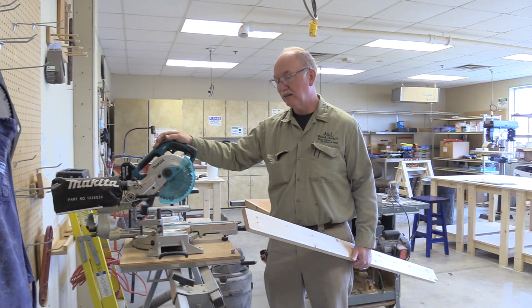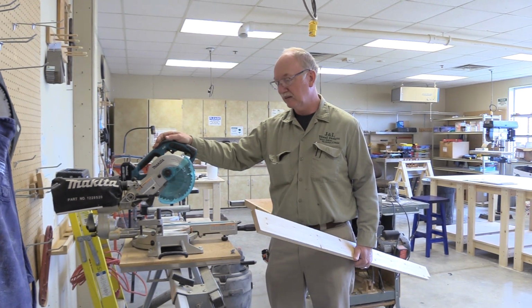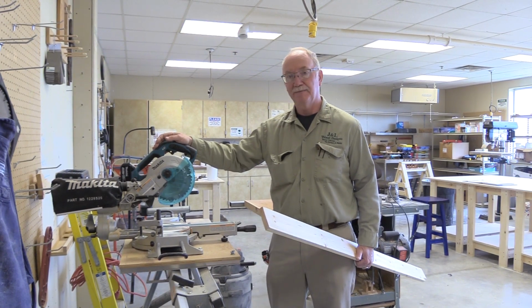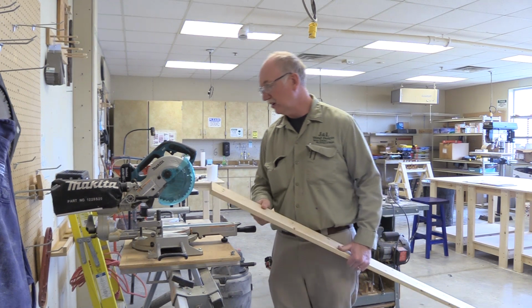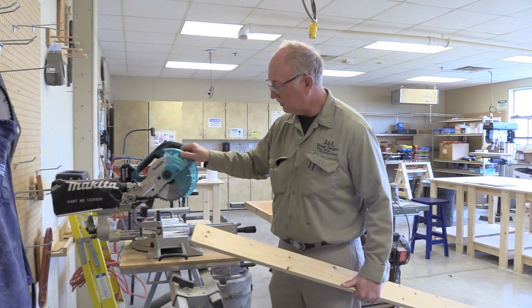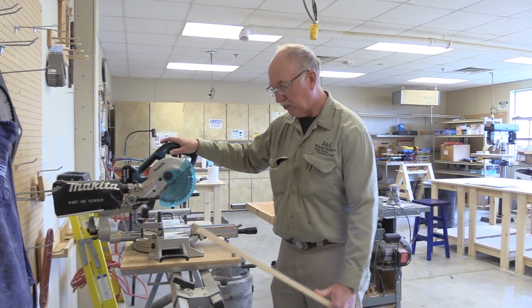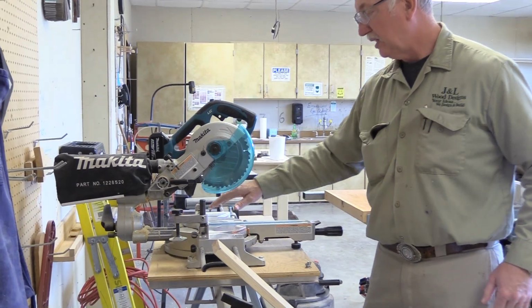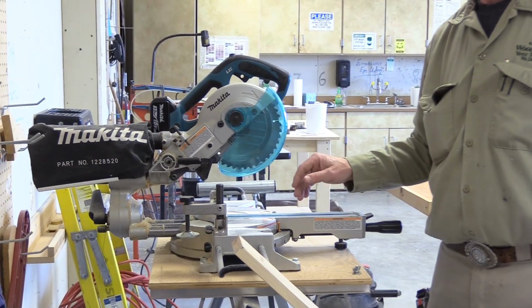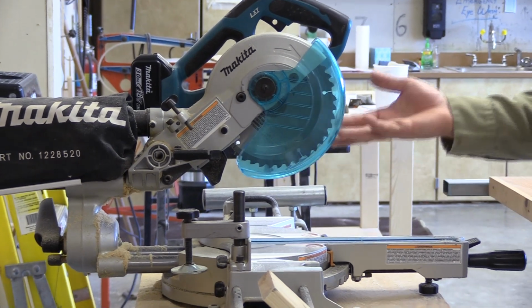Eventually we'll replace my saw with the school's old saw. We'll get a nice miter box. We'll get it in here and then we'll go from there. But anyway, one of the first things in regards to safety, you see this one's got this extra blade guard. Blade guards are incredibly important because people will reach in, measuring underneath the blade, and it's really dangerous to do that, especially with this huge exposed blade.